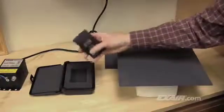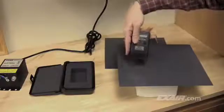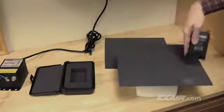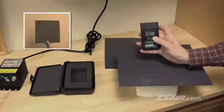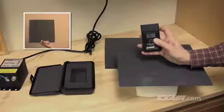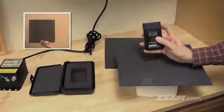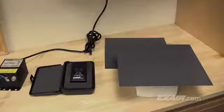This time when the static meter is used, it shows the high voltage charge has been neutralized. An ionizer will only remove the static electricity charge from the surface that it's exposed to. It's possible that the other side of the plastic could be fully charged and may require that another ionizer be placed on that side to neutralize it. In the event the ionized surface rubs against another insulator somewhere downstream, it is possible that the surface may become charged once again.